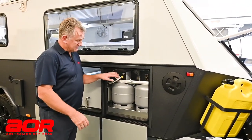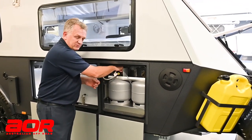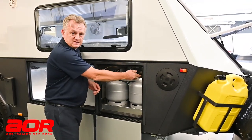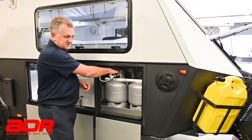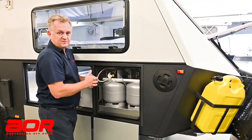To show you how to turn the gas cylinder on - this is the one that's connected at present. This valve we turn anti-clockwise to turn that on. The other one hasn't got the hose in it, so that's the backup side and we don't need to turn that on at all. To turn it off is obviously clockwise. We'll turn that back off when we're finished.